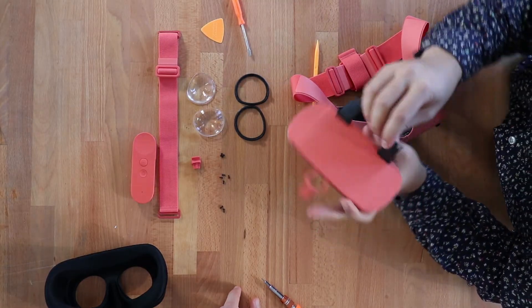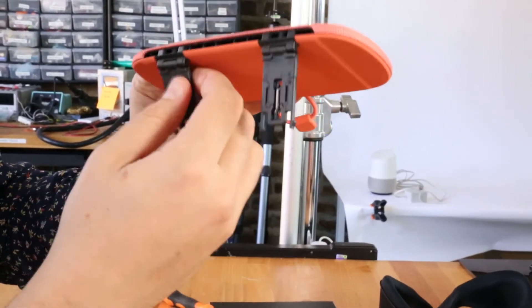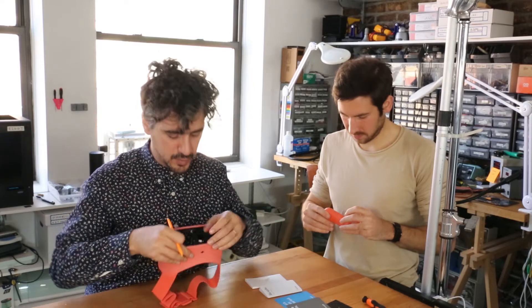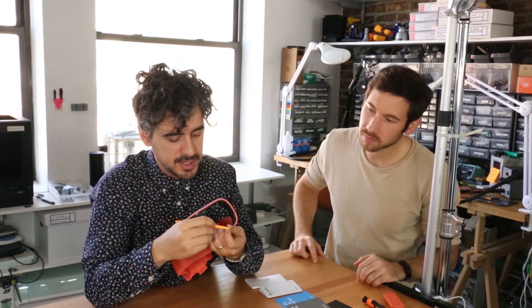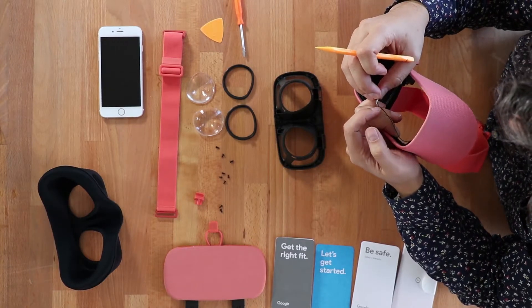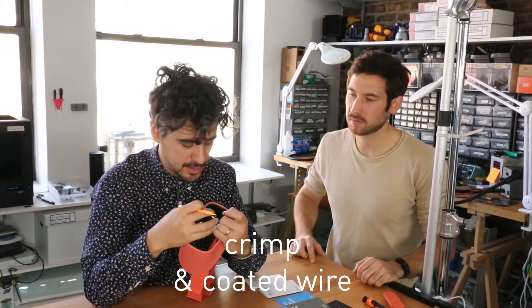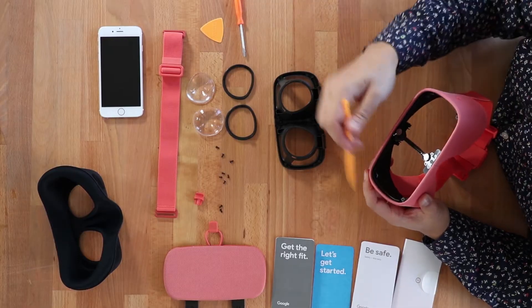So if you have a fat phone it can accommodate that — what a nice little mechanism. Spring, spring. We've got one more layer here: these are double adhesive-backed metal pads, a crimp connecting to a coated wire, and that wire lays in a track around here. We think this is how they're doing their gestural capacitance.